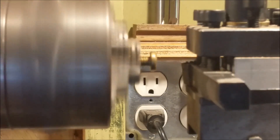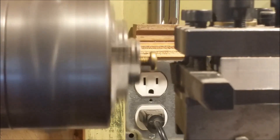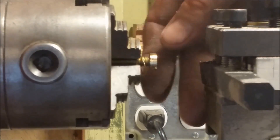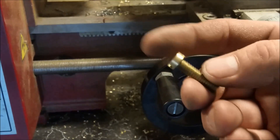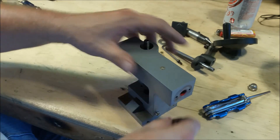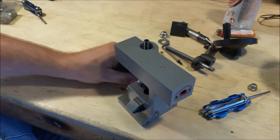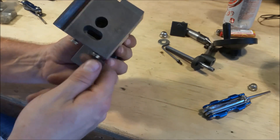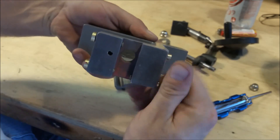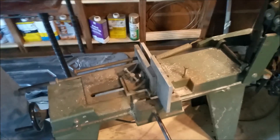So we have a good fit and we're going to go ahead and make the screws. I have a bucket of brass screws and I'm going to go ahead and taper the heads down. The first two that I make are rather large, and then when I go to fit them, some of them are not long enough and the holes that were already drilled were oversized on the first half and then undersized. So if you look here you can see that the ones I cut down even more actually sink in. One thought is that I can clean these all up and sink them all in, but at this point I'm just ready to get the thing aligned and see how well I can make that work.